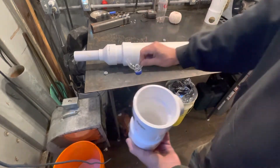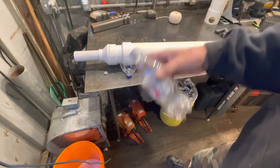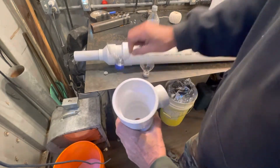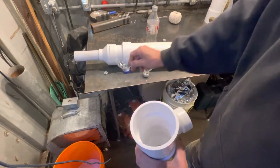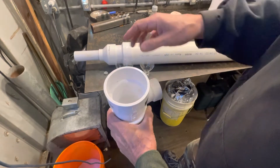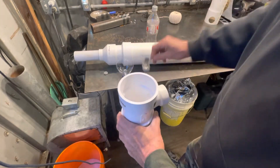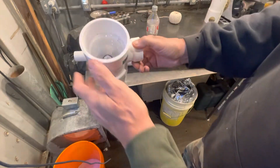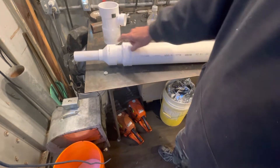These are just bottle tops from plastic bottles. This one's a Coke bottle — it's smaller so it sits down in there. This one's a drinking water bottle that actually fit inside. A two-liter bottle will fit on here, but Coke doesn't work because it's got grooves and doesn't seat as well. I just threw a couple of nuts in there to give it some weight — you just drop those in and that's your valve. It has to sit upright; if it goes sideways it won't work.